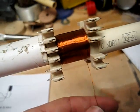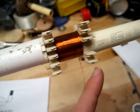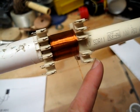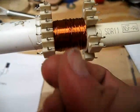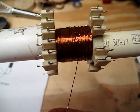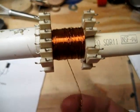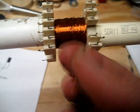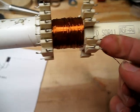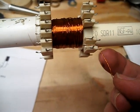Now I have six feet of tightly wound wire. I'm just going to continue to wind this on and exit it onto this terminal right here. I've wound it up and down this coil about six times, spacing the windings out — just going back and forth as I wound it. I now have the end right here and I'm going to bring it over, strip off this enamel covering on the wire, and solder it onto this point right here.